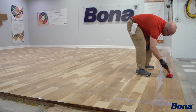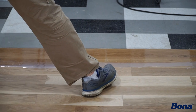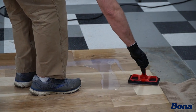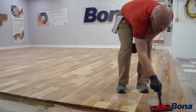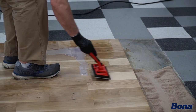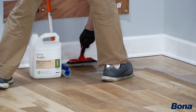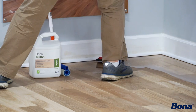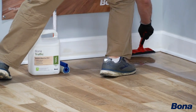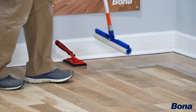Sometimes you might have to go a little bit cross grain on some product to make sure you're wetting everything out. The danger to watch for: if you've got really difficult drying conditions where things are drying too fast, the longer you leave the puddle exposed — especially up where you first started — the more chance something goes wrong or it sets up too fast. Make sure you've cut in both edges where you're going to want to bring that out.